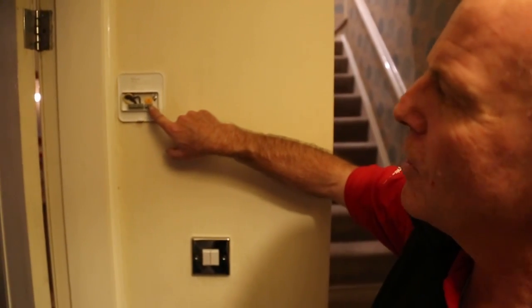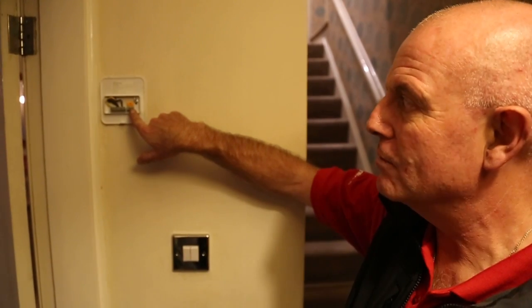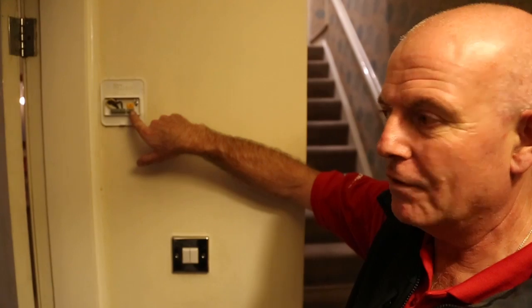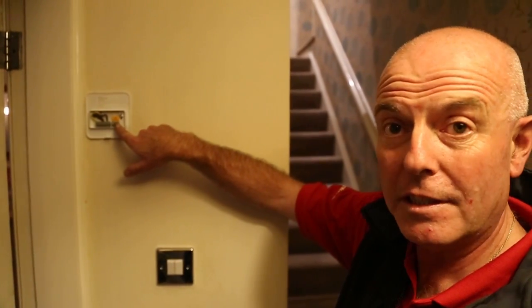Okay, one thing we haven't spoken about this afternoon is the digital interface. With these controls, you can talk back to any boiler that has a digital interface, 0 volt, 12 volt, 24 volt, often called E-bus. That gives you the advantages of making the boiler run more efficiently. It modulates.